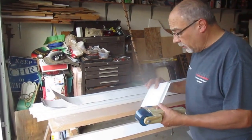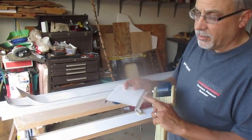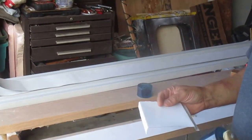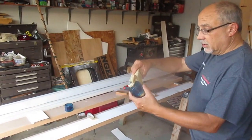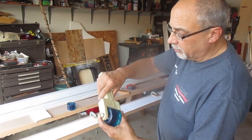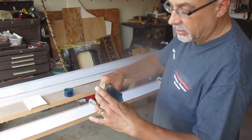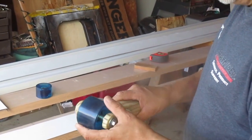I did a sample here and you can see I've got a 90 degree and I managed to do a compound bend — I haven't mastered that yet — but there's a compound bend here and a regular 90 degree. I'm going to show you how to use it. It's a simple handle; I notched it on my table saw, cut it, broke the corners, and drilled a 5/16th hole through. All you really need is a table saw and a drill or drill press.